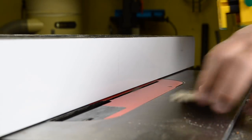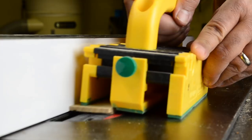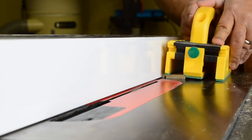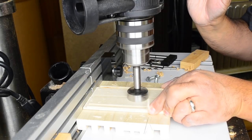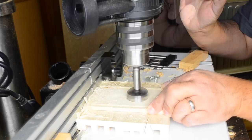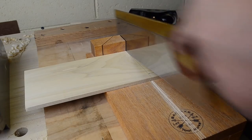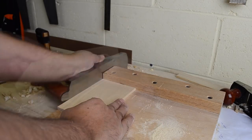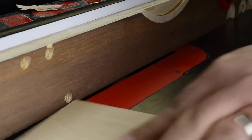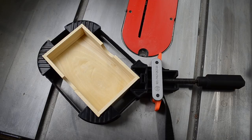The last part of this project is the dice tray, which is cut and assembled rather quickly. Once the pieces are dimensioned to size I just cut rabbets at either end on the long sides. Then I set up the table saw to cut a groove for the bottom to float in when it's finally assembled. After the first pass I just simply move the fence over slightly and widen the groove to its final dimension. An additional detail for the sides is a cut-out — I lay the long sides next to each other at the drill press, holding them in place with woodturner's double-sided tape, and then cut the detail with a large Forstner bit. For the tray bottom it's dimensioned with two cuts — one for length and the second for width — then both are trimmed to final dimension on the shooting board. Afterwards a rabbet is cut on the bottom face on all four edges using the table saw since it was already set up from the groove cutting, then it's assembled and glued together.